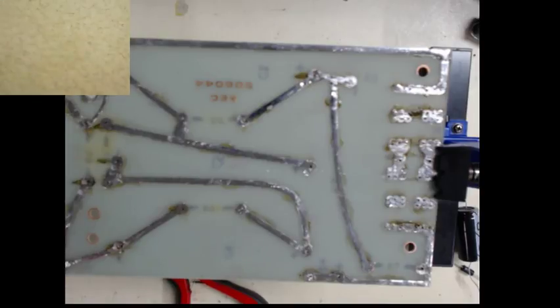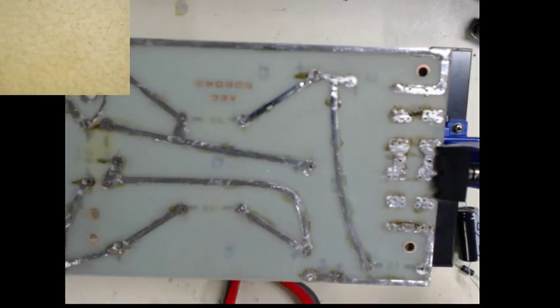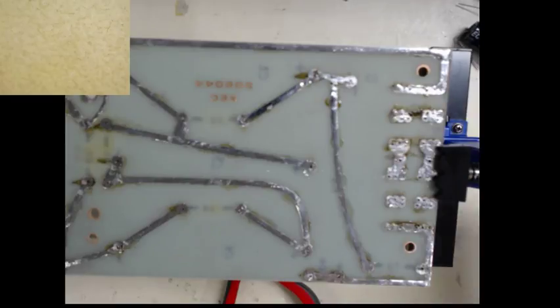They're two different diameters. The MG is 16 gauge, and the other one is 0.034 inches. So this is the one I'll be using on the board today, the fat one. I'll be using the smaller one on some other boards that we have to build for this amplifier to use for the cathode power and screen or grid power supplies and things like that. They're called tetrode boards, and we'll do the next live stream on that. Actually, the next live stream will be testing this thing, so we'll see how it goes.